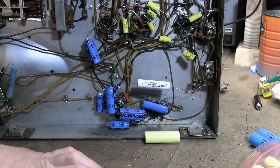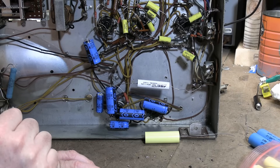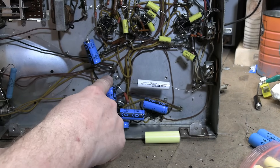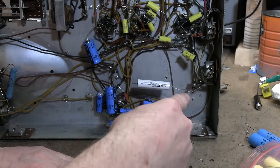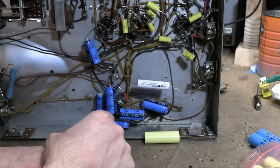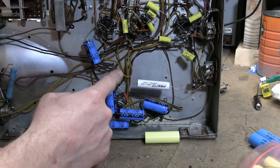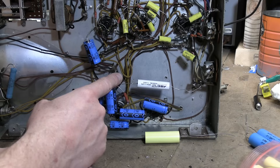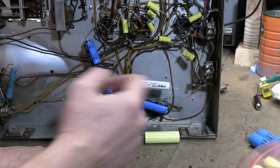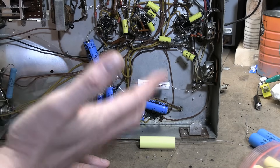I was tempted to try observing the waveform with my new scope with my x100 probe, but unfortunately it's only good to 1.5 kilovolts. On the low-voltage side of the cap lead, we're going to have a sawtooth that's say 0 to 300 volts — a very linear ramp, sharp drop, linear ramp, sharp drop. On the other side, we've got around 5,000 volts with that sawtooth superimposed on it. I suspect that with the capacitance being too small, the waveform is getting distorted as it goes through the cap. On the low voltage side where I could safely hook up my scope it might look fine, but that probe is only good to 1.5 kilovolts, so I just can't attach it there. But we can try substituting — if it looks good, we can assume that was the problem.